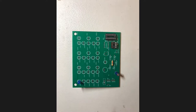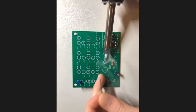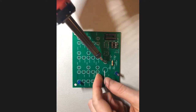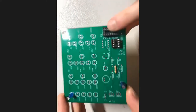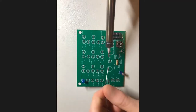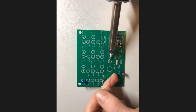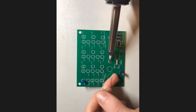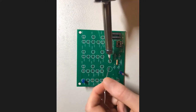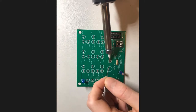Okay, so if we're going to do a solder bridge, what we're first gonna want to do is put solder on each pad. Like this. Just put a good amount of solder on there. All right, so each pad should now have some solder on it. Hopefully you can see that. Then what you can do from there is just keep on adding solder and making sure it's melted until the two form a connection. All right, unsuccessful that time. So we'll go back to that in a second. And as I mentioned, this is slightly more advanced and it'll take a few tries to get it sometimes.